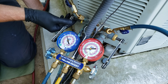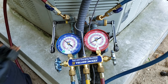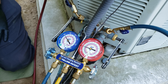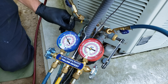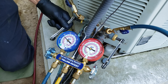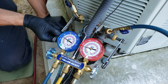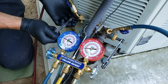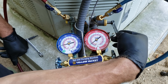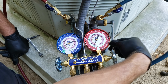I like to let the system turn on first and then shut the liquid line down. We turned the thermostat on, now I'm pushing the outdoor disconnect in to start the unit. Now that the unit is running, I go ahead and shut down the liquid line, then monitor the pressure as the system pumps down. Normally you can just use two fingers on the ratcheting service wrench to close the liquid line service valve. Let's also get a head start on our vapor line.